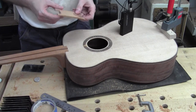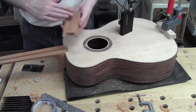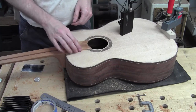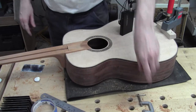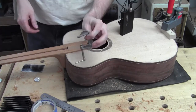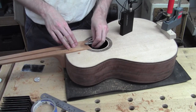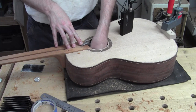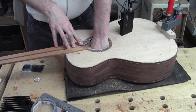So I've got this method that I'm working out that I think is gonna be okay. What I'm doing is, this side is basically flat. I set it down here on the surface of the area I want to get flush. And I've got this tiny little C-clamp. It's so small that there's not enough room for a caul, but on the inside I'm not real worried. And inside of here we just clamp this shim right in place,